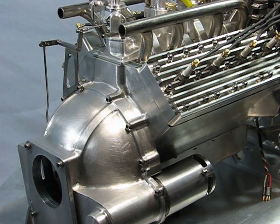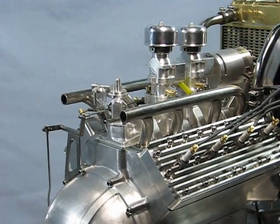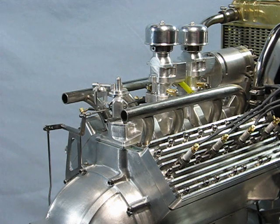The spark plugs are homemade with Corian insulators and steel shells — the thread is quarter-32 size. The intake was made from 6061 aluminum; it represents a dual plane type but is only a single plane, with each carb feeding only four cylinders.